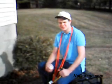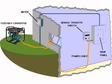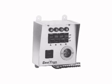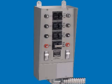There are basically four ways to install a transfer device. One: use a load-side multi-circuit transfer switch. This is a box containing four, six, eight, or ten individual transfer switches. Each of these is wired in line to selected branch circuits at your breaker panel. This is simple to install and gives individual control of each circuit, whether to power from the utility source or generator.